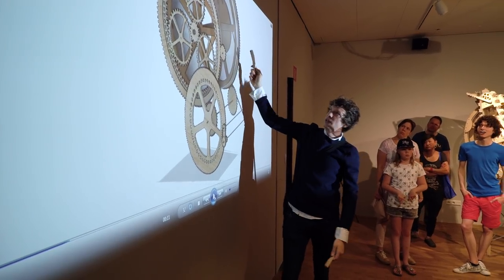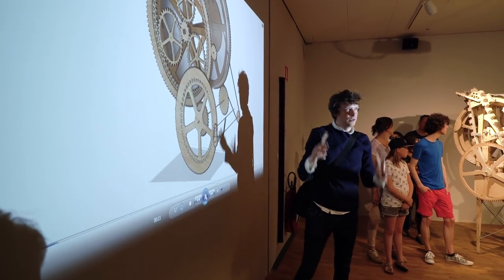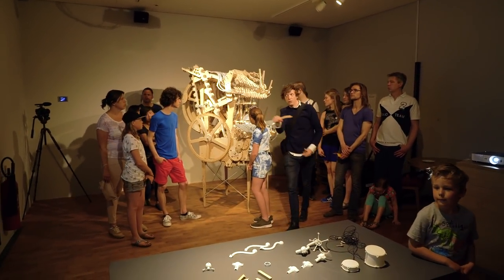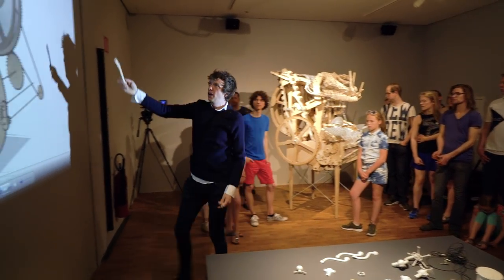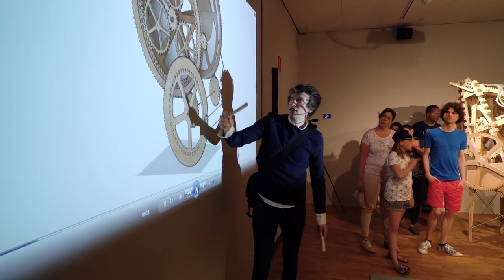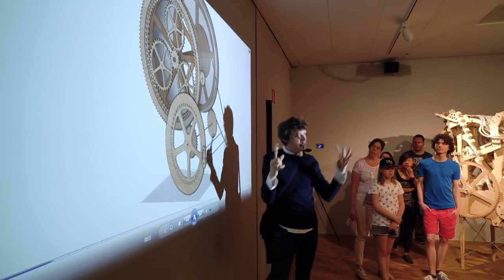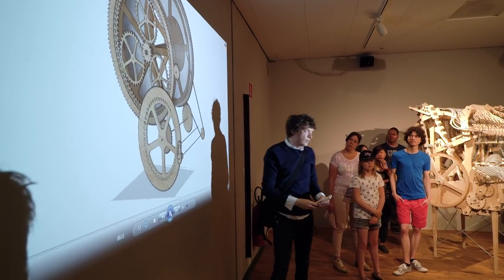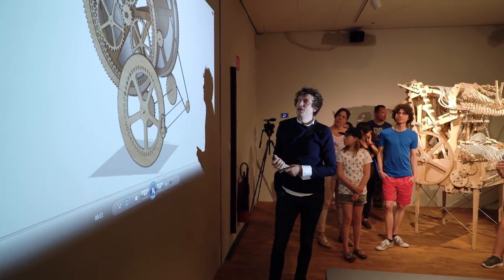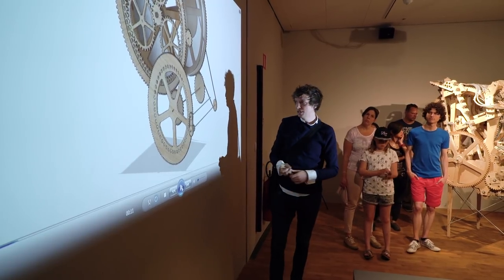And we also use the space inside the programming wheel, because if you see, the programming wheel is a big thing. So we're gonna put the flywheel inside. The flywheel on this machine is here, and that's the wheel that makes the tempo continuously. And the flywheel is gonna be inside the programming wheel on the other side. And this planetary gear, this is called sun gear, planet gear, and ring gear, this planetary gear is also inside the programming wheel. So we ordered the drum, like Jules has told me it's called. So that is a big difference as well. The programming wheel is actually even gonna move in the opposite direction from this machine.